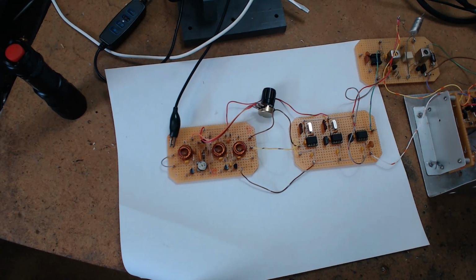Now, this one guy reviewed an SDR. He had one that was the Russian made and one that was a clone, and he kept saying how good the clone worked until he burnt it out. But he's reviewing two radios, and one of them's burnt out, and he's showing you what's wrong with it. And what a horrible review. And the guy's quite smart at repairing, but little by little, I'm starting to see what he doesn't know. I was watching that review, and I'm like, tell him that there's no front end on the radio, but he doesn't know that yet. He's never looked at the schematic, and if he goes to repair one, he's going to get the shock of his life.